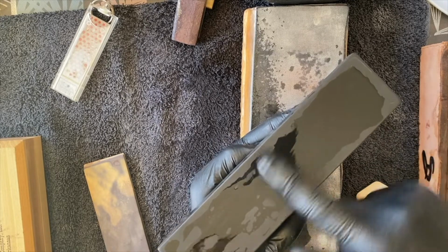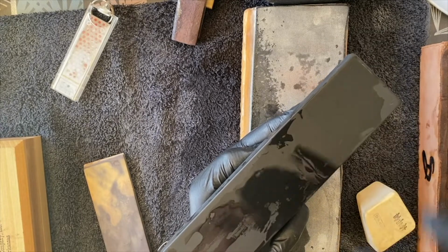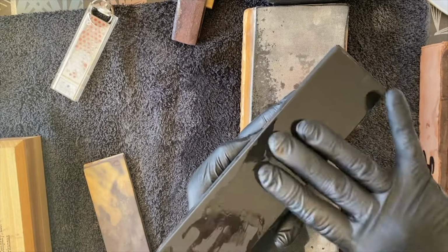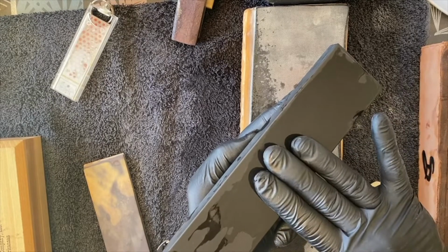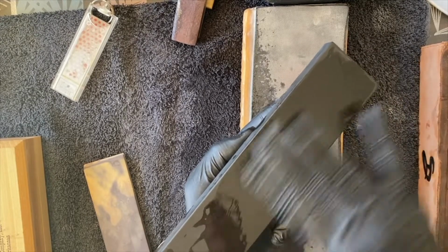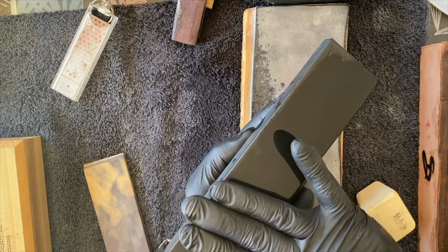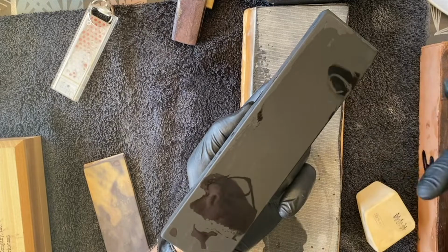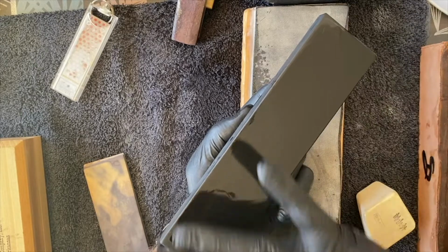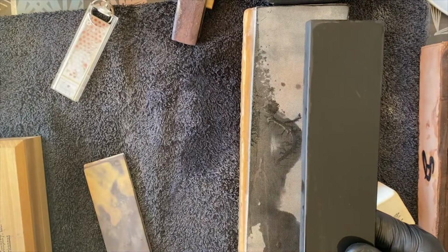Okay? These stones are finishers. They polish. They don't abrade to any extent, really. Especially the very fine stuff. Imagine trying to polish a dent into a piece of steel, because this is what you're doing. You're polishing. So you're not going to destroy your razor, grind the spine away. That can't happen. So start with the finisher, see if you can maintain an edge, and then when you're there, then you can step down to see what you need.